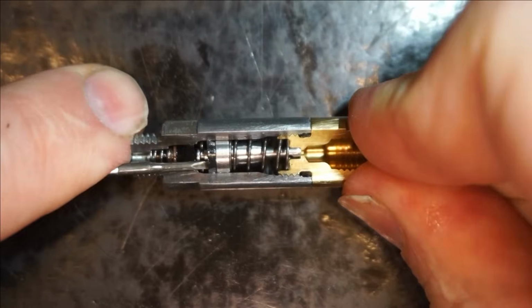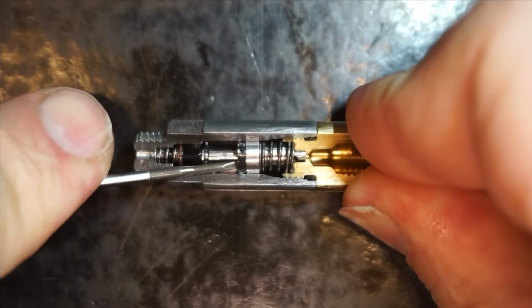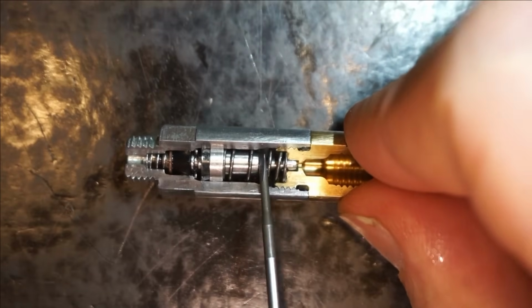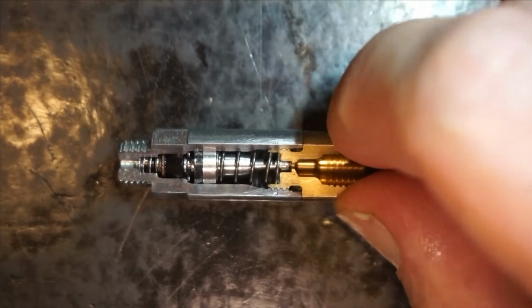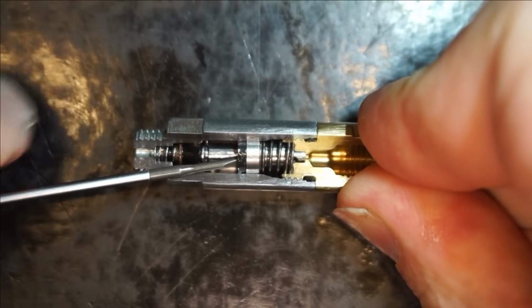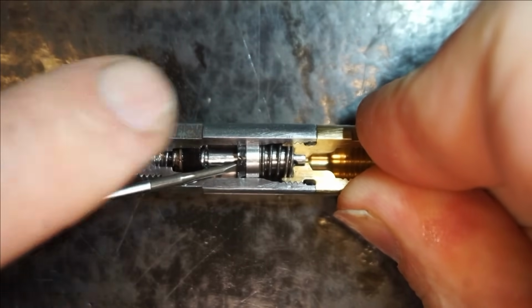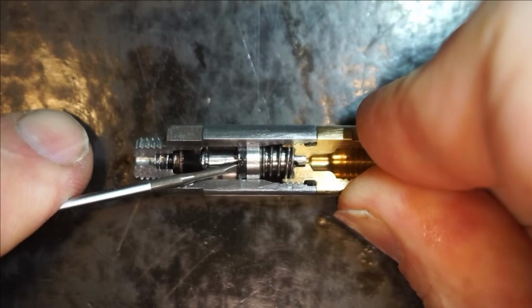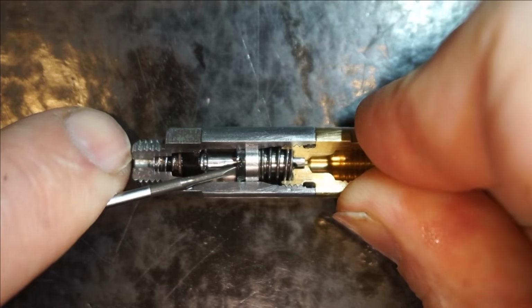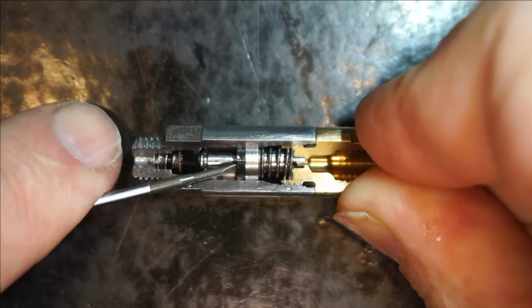And this pumping action happens until the piston reaches its upper end stop. And that is when this shoulder here hits the brass piece up here. So whenever that happens, you see we can keep supplying pressurized oil to that piston distributor, but nothing further will happen because the piston is in its end stop and the check valve piston will keep the transfer tube closed. There may be other piston distributors at this very moment still moving on the machine, but that doesn't matter for this distributor.